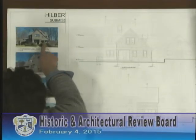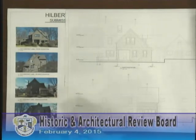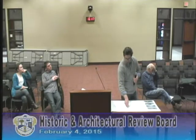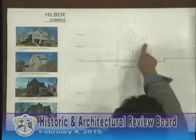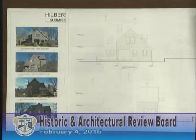Just a kink — and you would actually get ceiling height at that wall line that you don't have. That's an enormous piece of roof. It's essentially like the front elevation, how it comes down and right at the bottom where it meets the porch, it kind of kicks up a degree. It's not an angled definition — I think it kind of is a curve. But I think that would bring it more in keeping with some of the things going on here. It's a really easy move to make — that hinge would happen pretty much where the bay meets it, and it would just follow back to that dining room bay. That's a simple move and a pretty good suggestion.